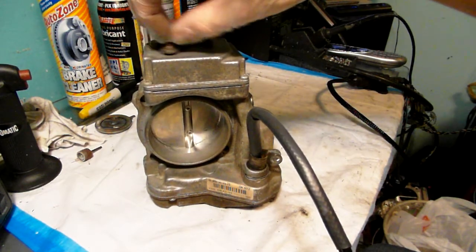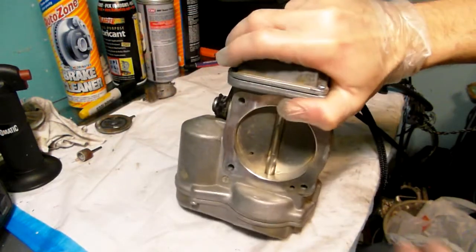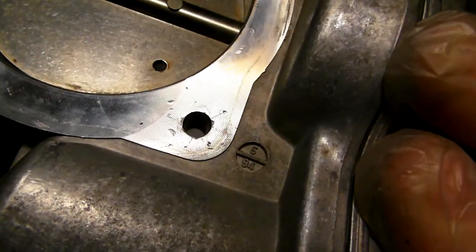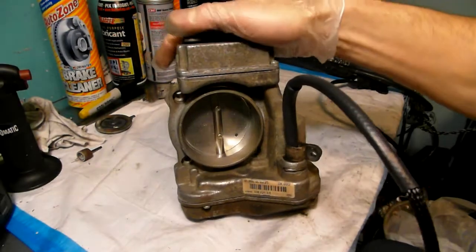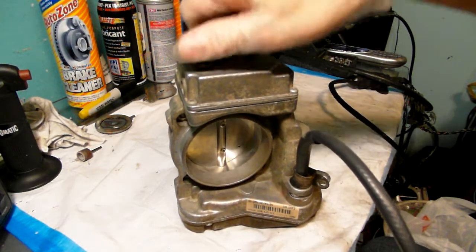When I energize it, you can see the unit works just fine. There's another production date hint — you can see a little stamp on the casing: 5 of 94. This is when the case was made, because the unit itself was made in November 1994. All units made up to early 1996 would be prone to this failure.